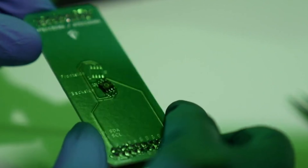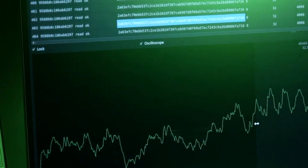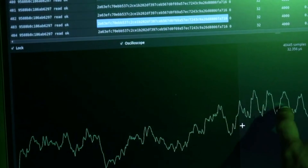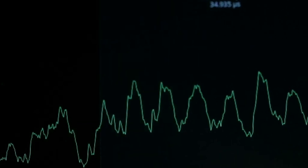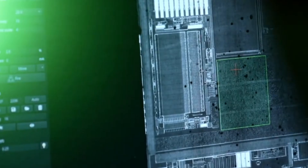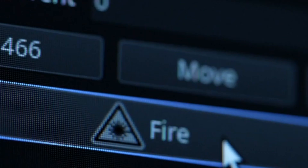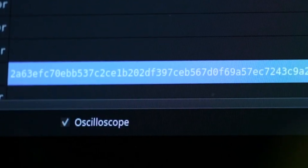Next they solder the chip onto a test board and connect it to an oscilloscope to monitor power patterns, identifying specific activity tied to secret information stored in memory. The hacker carefully analyzes these patterns to pinpoint the exact transistor to target. To break past the chip's protection, they use a photo laser to confuse the circuit, making it think they're authorized to access the wallet's keys. Since the chip is microscopic, they have to do all of this under a 100x microscope. By firing the laser at different points, they watch how each transistor reacts — a red dot indicates no vulnerability, while a green dot indicates they've found a weakness. At that point, the attack is successful and they can access the wallet's seed phrase.